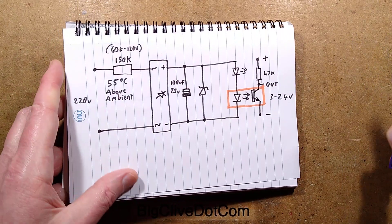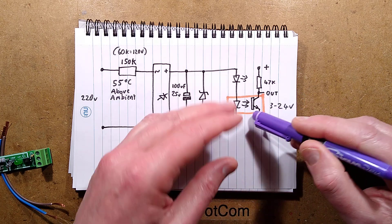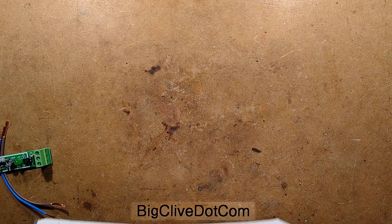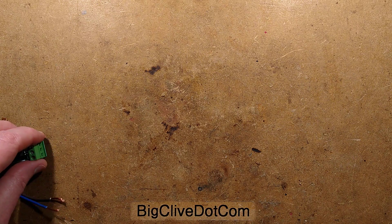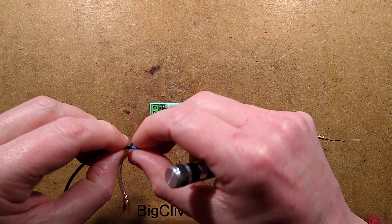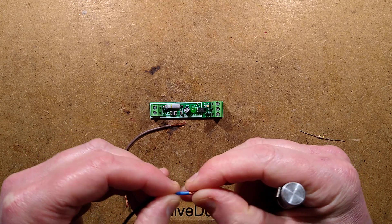I'm going to take a supply through an LED straight to the transistor - because the transistor is just floating in thin air it's not referenced to anything, I'll just put the resistor in the negative. So I shall put the power supply on, get a screwdriver, get the cable I have prepared, and twist and fold stuff into that terminal.